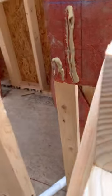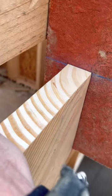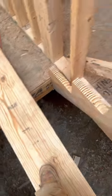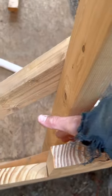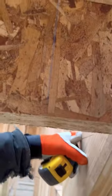So I just set a nail into the stringer, 6 inches up. Throw a little glue on there. Slide her in. Bring her down so she lines up there. We'll put an angle bracket hanger on there, plus it'll get nailed to the wall. Room for drywall and a trim stringer to go on here. Just start putting it together like that. So just shot some nails through the back of the three quarter. Angled some toenails up into the studs.